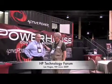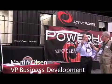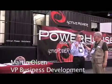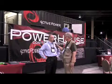That's what keeps it spinning. We're standing in front of the powerhouse over here, which is a 40-foot container — essentially the same type of setup as the pod — but it contains all of the power and cooling utility that feeds the pod and makes it run. It ensures optimal power quality, and when we have an outage that will eventually happen on the grid, we fire up our generators and continue to send power to the pod itself.